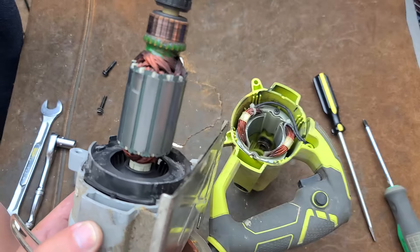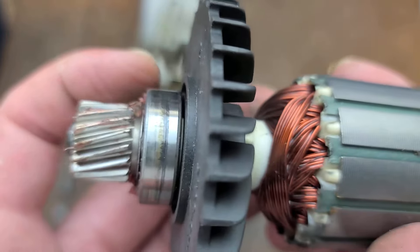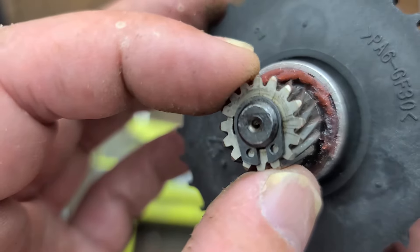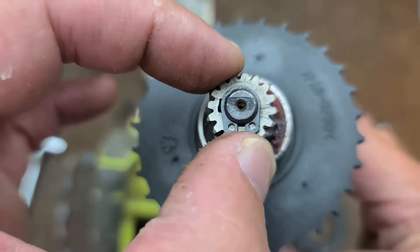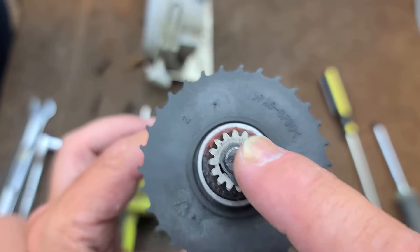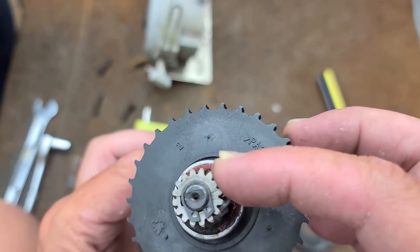The reason being is over long periods of time, the dust from cutting tile — particularly if you run this dry — basically starts sandblasting the actual windings themselves. I've seen in well-used rotary hammers and stuff where some of these wires that are sitting up high are more in the airflow and that powdered ceramic tile just slowly starts abrading the windings over time. But nonetheless, I'm sure this will last quite a few cuts. There's just not a lot to criticize about this tool. The fan shroud helps provide some protection for the bearing, but it doesn't need a ton. Rubber-sealed once again, and then we can see this bull gear is actually so large — it's not even press-fit, it's just entirely relying on the little key and a tiny little snap ring. They put on just this big old bull gear as wisdom. They could have just used a tiny motor shaft and made the driven gear smaller to give it the same ratio, but having them larger like this on a tool like this saw will really help with the longevity.